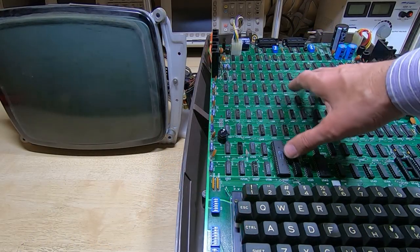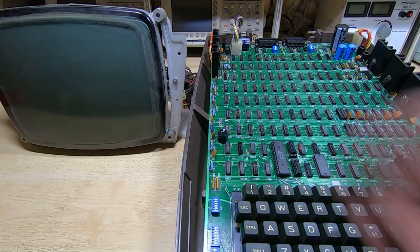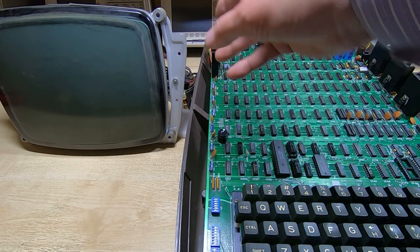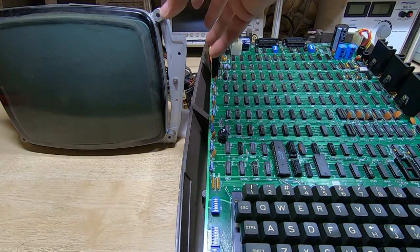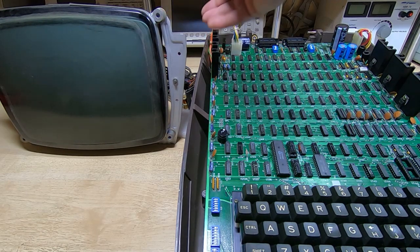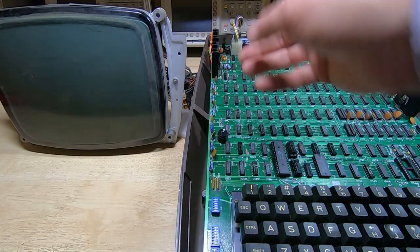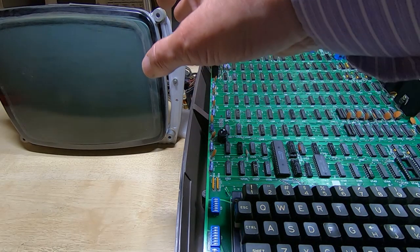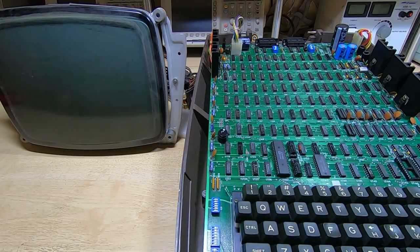That's the main board dropped back into place. I've got the CRT just temporarily attached. I probably didn't mention it in a previous video, but I'm sure you guessed anyway — this is upside down. It's just safer running it like this with the high voltage at the bottom rather than the wire being stretched all the way across. It's less likely to arc onto anything and I'm less likely to stick my hand on it. I'll power this up and dim the lights once it's powered up, and hopefully you'll be able to see something on the screen.